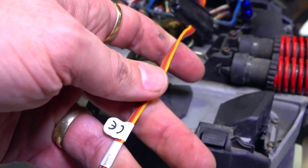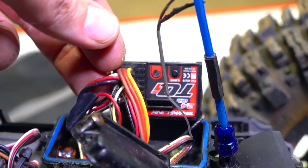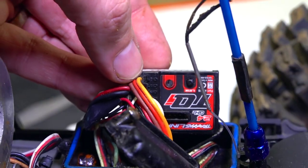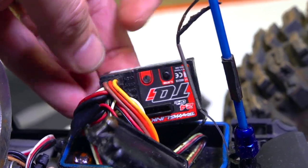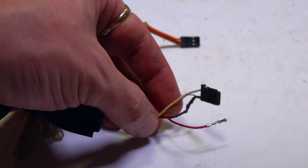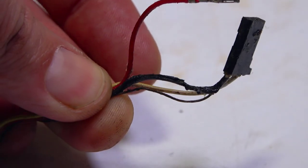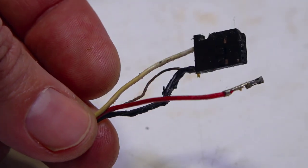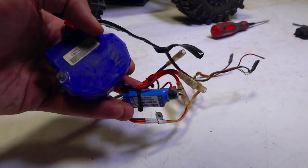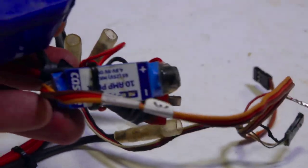For beginners that are afraid of doing this kind of thing, all I'm doing is following the wire to where the channel is. You can see this is the first channel here, so I'm just going to remove that — noting that the signal wire, which is the bright wire, is towards the antenna when it's upside down. Look at this — I completely cooked the end of this in the last video. That is the ground wire that is melted right out of the sheathing. I'm so glad I decided to change this out.